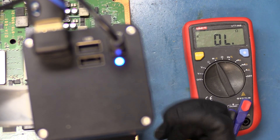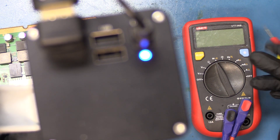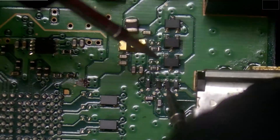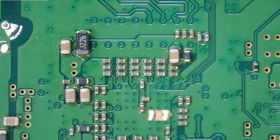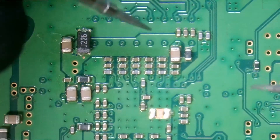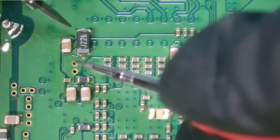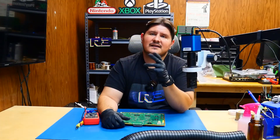Let's go ahead and take a look at the diode that was shorted previously. Right as I was about to use it, the meter decides to die and go to sleep — very inconvenient. The board is still a little toasty, but that's fine. Looks like our short is no longer present. How about where the Silicon Image resides in the back? We were getting about 22 ohms, which was very close to the 17 ohms we were seeing on that diode. We are still shorted here, but that could be normal. We're not seeing a short on that diode in the front, so it's safe to say we can install our replacement Silicon Image chip.